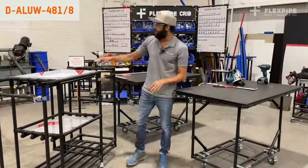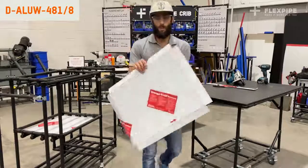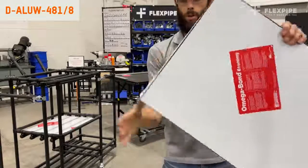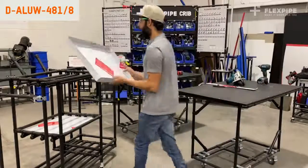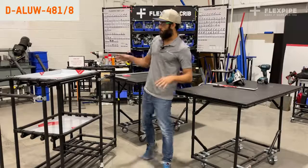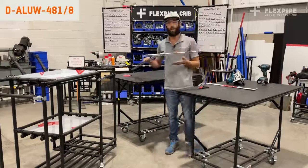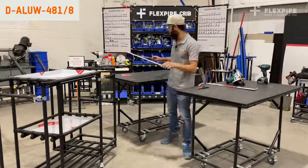That's a really cool thing about using the aluminum composite. We've scored the sides, we can bend them — it's pliable. You can break it apart and make all kinds of cool little boxes that are really handy, and you don't necessarily need a table saw. So if you have a cutter and a straight edge, you can use the drywall method: score it, bend it, break it, and shape it in many different ways.